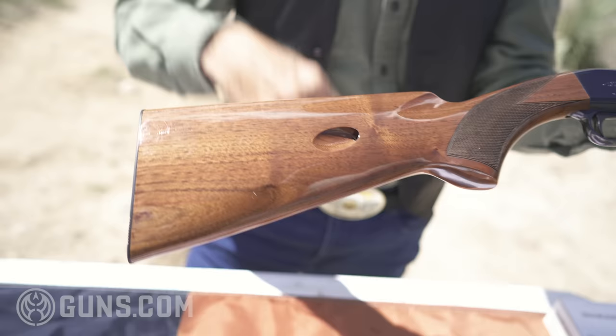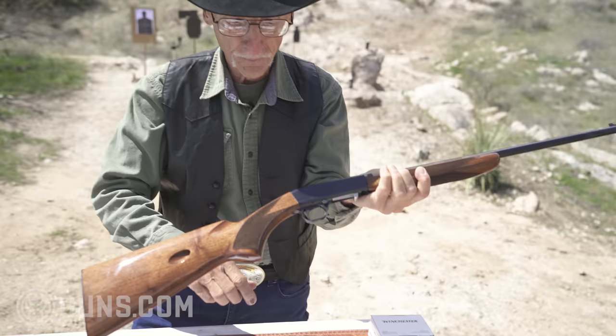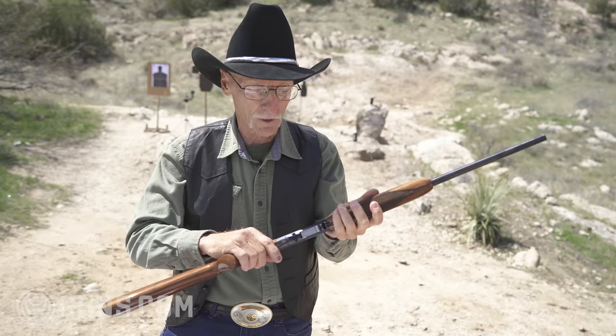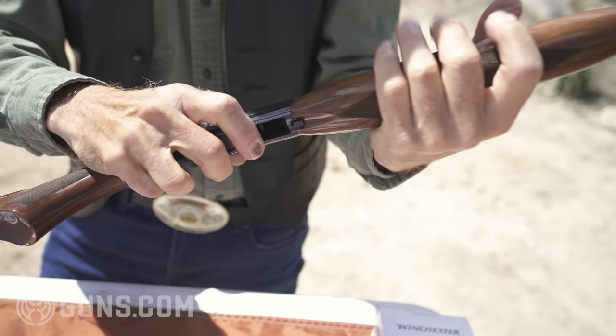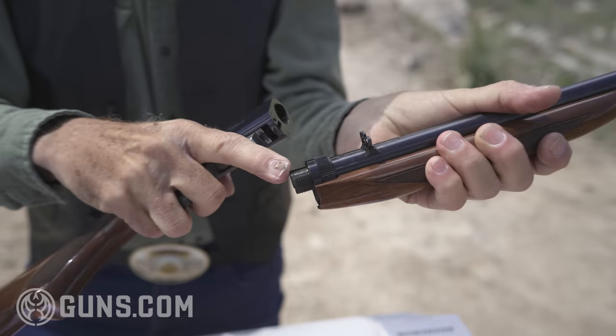Browning looked at that and said, 'Nah, I'm not going to do that. I'm going to put my magazine in the stock.' That's how you load it, folks — through that hole in the stock. The rounds are facing forward, ten in a row, and they go straight into the chamber. What a great idea! In 1914, all of the guns — the Stevens favorites, the .44½, the Winchester pump guns — they were all takedown. This gun could come apart. There's a small switch here — push it forward, pull the bolt back, and turn it half a turn. There you go, it's in two parts. Notice the interrupted thread — you don't have to turn this 20 times to get it out. The interrupted thread allows you to turn it a quarter turn and pull it out.